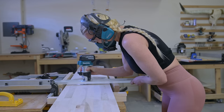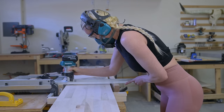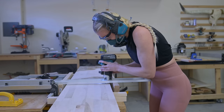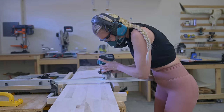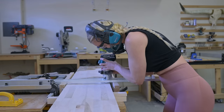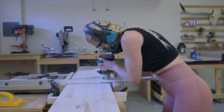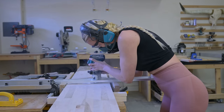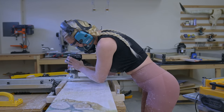Next step is to shave off any excess resin. I used the simple router sled that I built a while back. Just pull a handheld router back and forth on the sled to take off a layer of the surface. The bit I used I will link in the description below. Once you've taken off all the extra resin, it's time to smoothen out the piece by sanding.